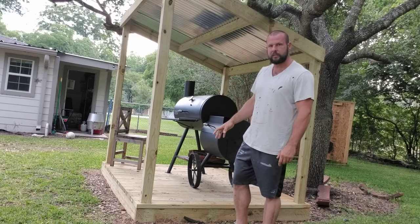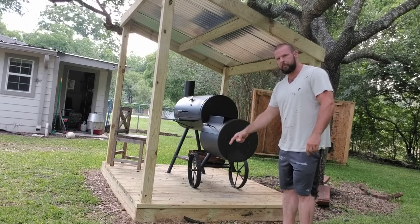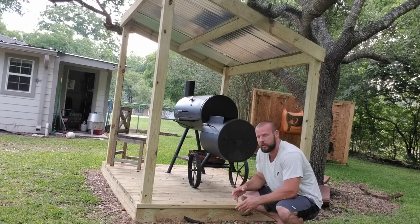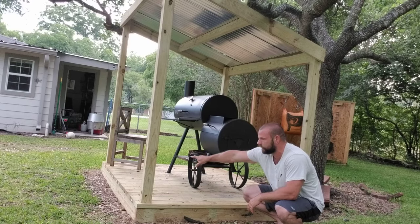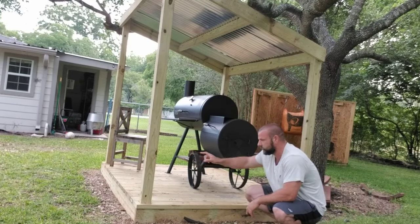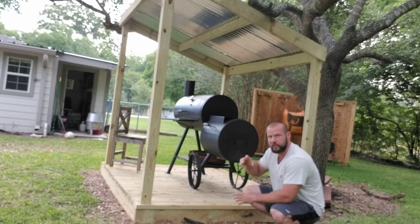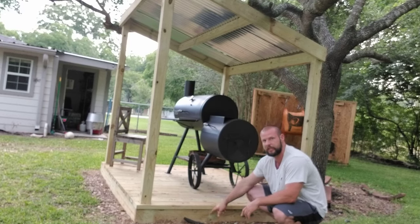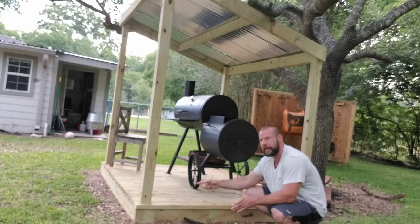What I basically did was build this bottom square out first. These two by sixes down here are six foot. The others are full eight foot — actually cut down by three inches to make a total of eight foot. So this is a total of eight foot long and these are cut to six foot, meaning cut from 96 down to 93 inches.